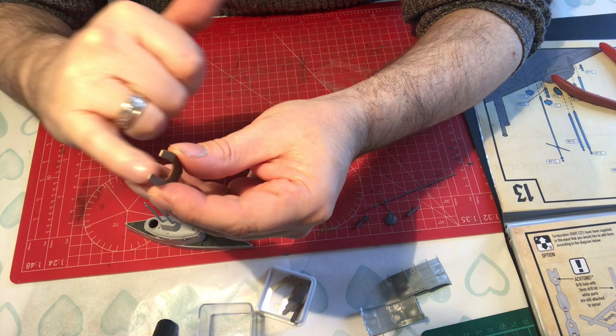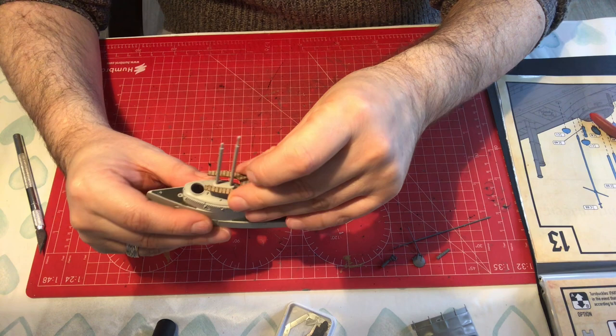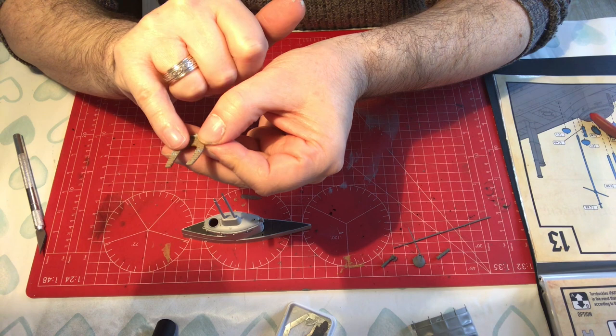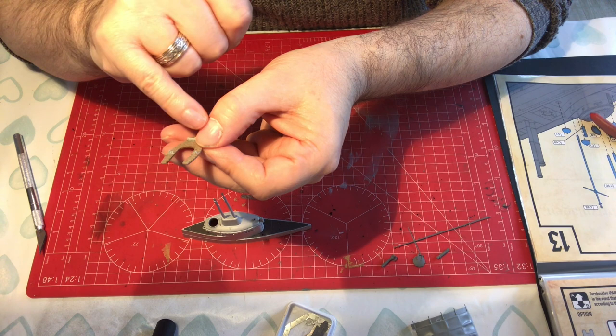Okay, I've now got that fitting. That goes together much nicer now. And all I've really done is thin down these lugs here. So there's a little recess in them, and I've trimmed away the inner part of the thick wall so that it's level with the thinner bit of the wall. When you look at the part, you'll understand what I'm saying, and that just makes it fit.